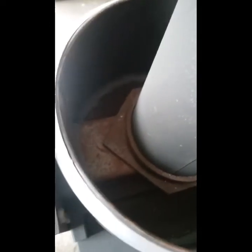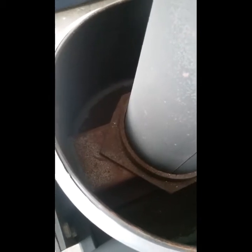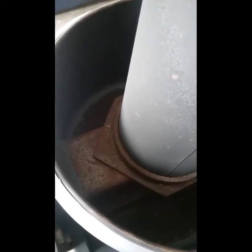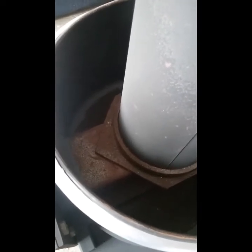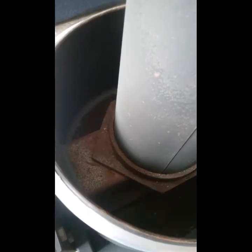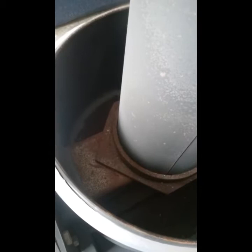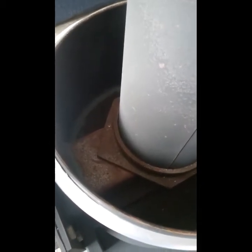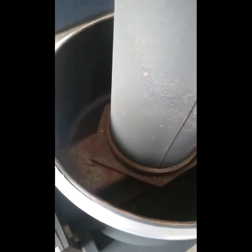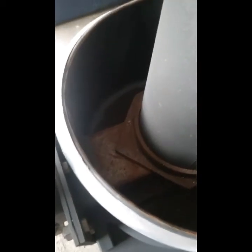As you can see on the inside — get a better look at it — I was gonna put refractory around where the pipe comes into the inside of the stove to get more heat, but most people have problems with that. When it's insulated it gets really hot, glows red, and over time it basically eats the mild steel away. I do get about 600 to 700 degrees out of this stove without insulating it.